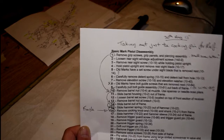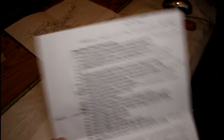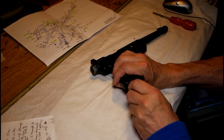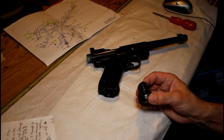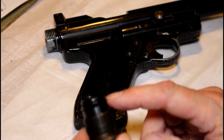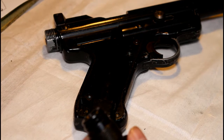With the pistol grips off, which was number one, I'm going to take out the piercing assembly - that's number one as well. It's just a matter of unscrewing the piercing assembly out of the handle of the gun. This is our first O-ring that we're going to have to replace. You should be able to see here that there's an O-ring around the top half, and this ensures that when you screw this plug back into the gun no gas escapes. This is the first part we need to replace.